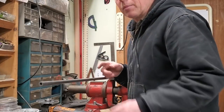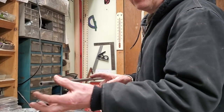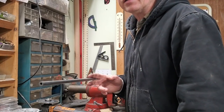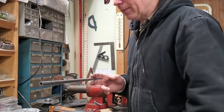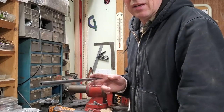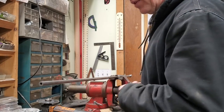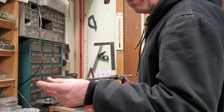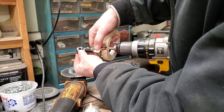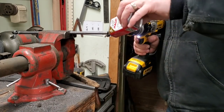I'm about to cut my steering tie rods — this is half-inch OD by quarter-inch ID, eighth-inch thick wall. I had to find this at Metal Depot online, then later found it at my supply place one big piece tucked way back that I didn't see — so I paid premium price for it. Anyway, we're going to start threading the ends. Tap Magic — every shop's got to have Tap Magic.